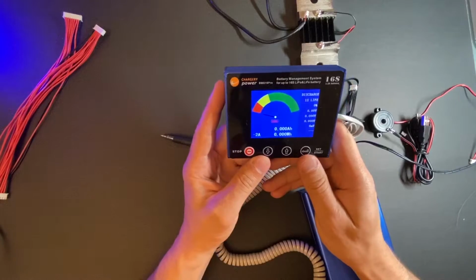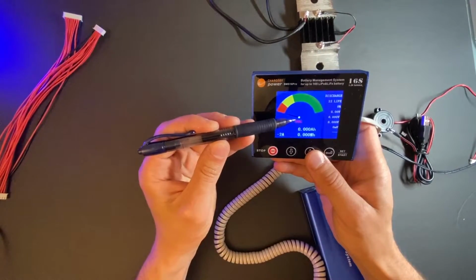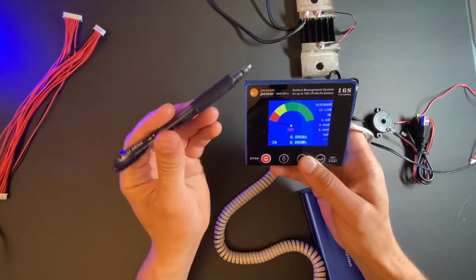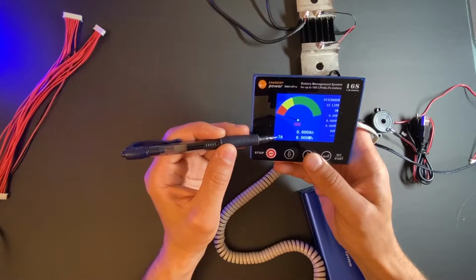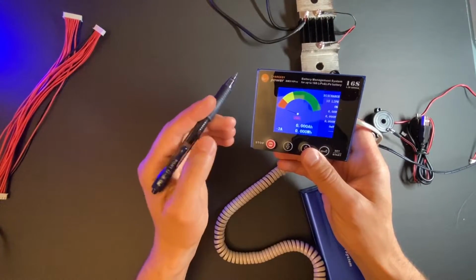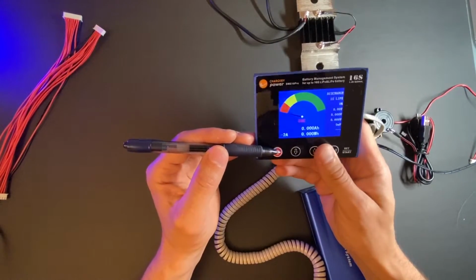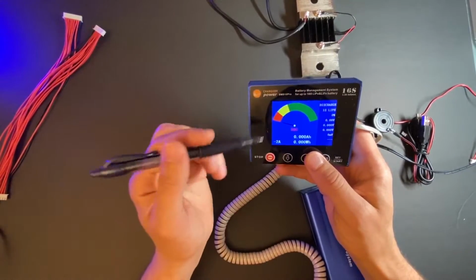So this is the home screen. What you're gonna see here is a state of charge, which is also configurable. Then we have amps, how many amps going into batteries or out from batteries. Right now I don't have the shunt connected, so it's reading -2 amps, and all the setup we're gonna do in the next video. In this video we'll just go through settings.